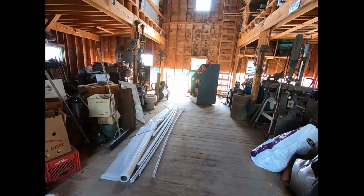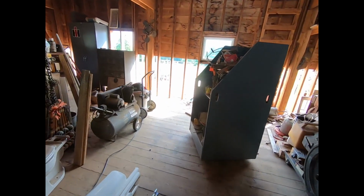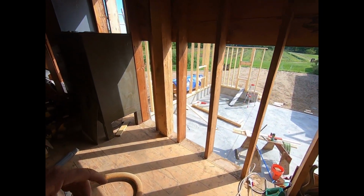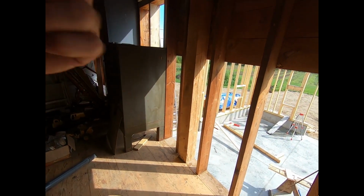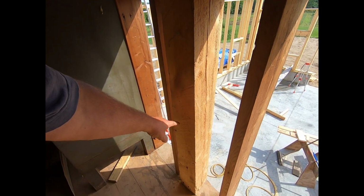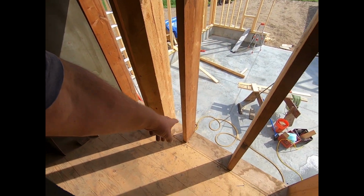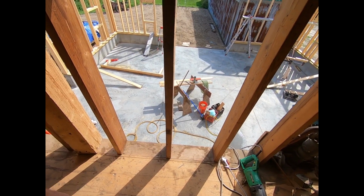We've been making a heck of a mess. So where we were going to tie onto the barn here, I've got my doublers set up all the way across, which I'll show you from the outside in a minute. And we got beyond the 6x, which I do have to bore a hole through. One of the floor trusses is going to come right here. But anyway, this section right here has got problems.